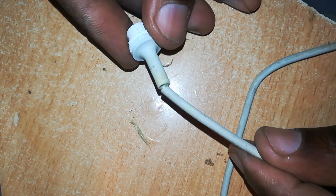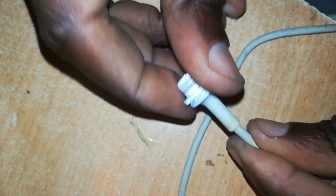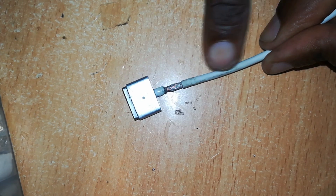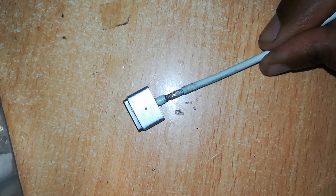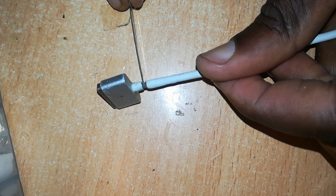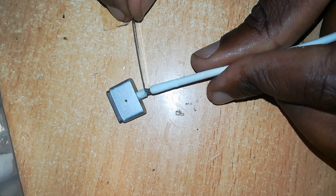The end of the cable will slide into this rubber junction. If you don't know how to make such a junction, check my other videos — I may also link them in the description below. To close or cover the joint, simply pull this rubber insulation over the joint slowly until no space is left. Before I fully close the joint, apply some glue to the remaining space so that when we pull the rubber insulation, it will stay in position and not come back.